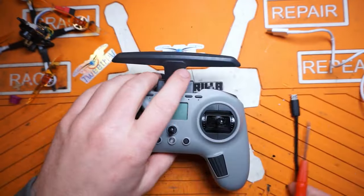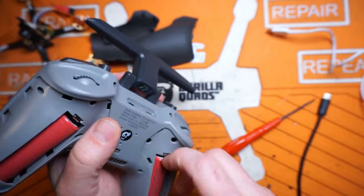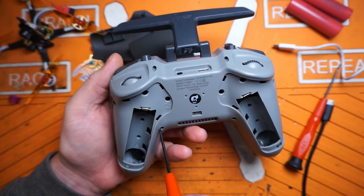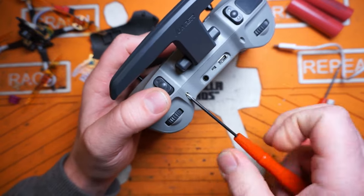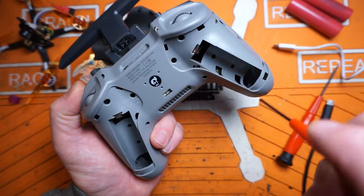Next, we need to take the radio apart — it's not very hard, only 10 screws. If you saw my last video, it's pretty easy. Go ahead and turn your radio off, pop the back covers off, take your batteries out, and remove the 10 screws around the perimeter. Now that we have the radio unscrewed, let's disconnect these two potentiometers just to get a little more space to work. What we're looking to get to is this boot button right here.